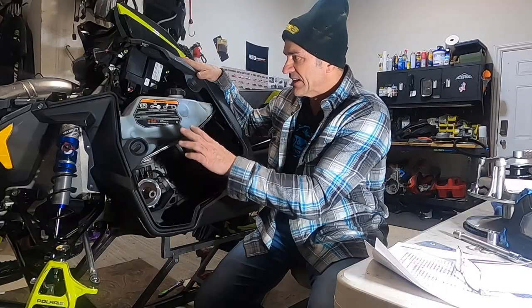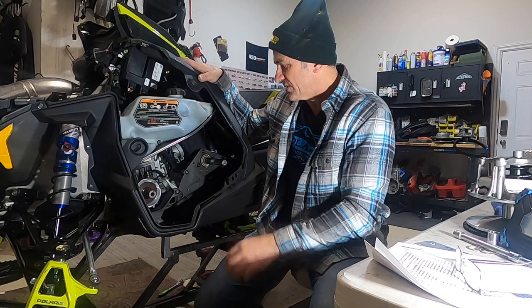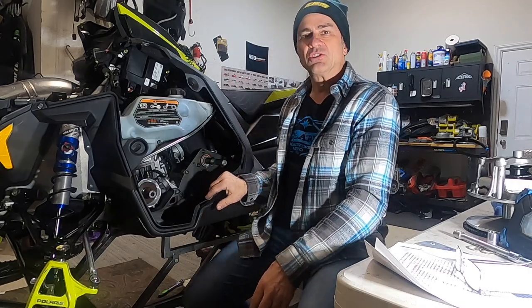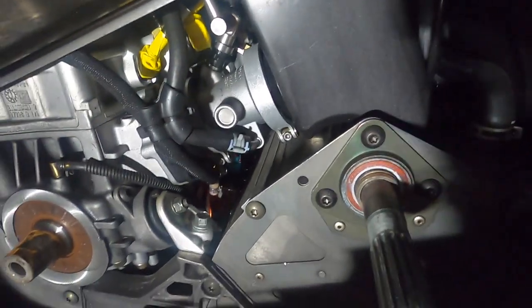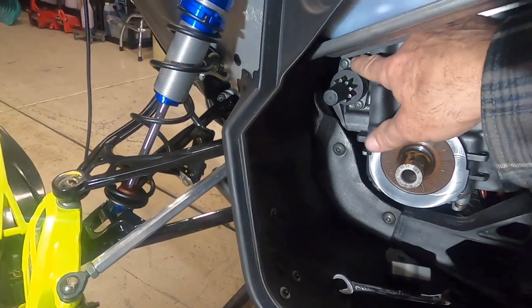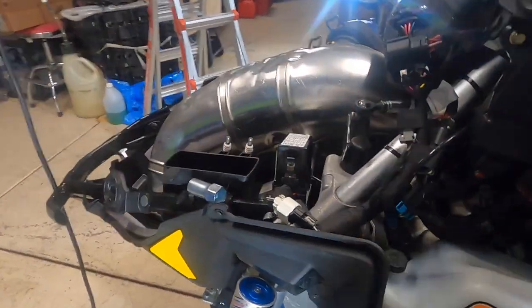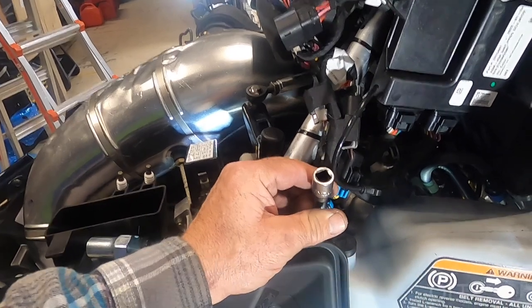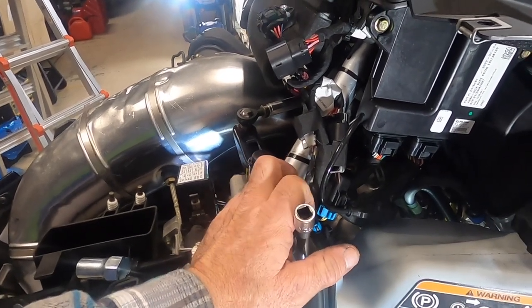Now we've got our side panels and hood off and we're ready to replace the motor mounts. Here's the one motor mount on the PTO side towards the rear — it's held on by two 13mm bolts. We're going to take those off. On the same side, the front motor mount up here needs to be loosened because that's going to be our pivot point. There's a 13mm bolt down in there — we're going to loosen it one and a half to two turns. We're going to take that rear bolt all the way out, and just loosen the front because that bolt is going to be our pivot point for the motor.